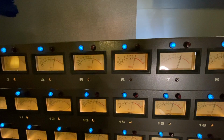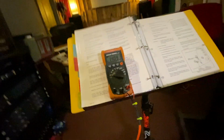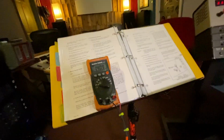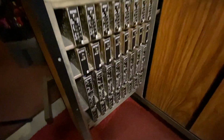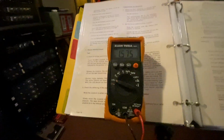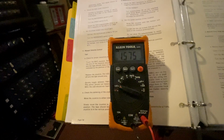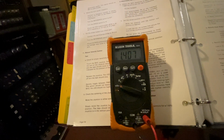Now I already did channels 1 through 7. I'm just going to show you 8. And there's channel 8, and we see it's down, right? So 1.4, we're high. So what I'm going to do is I'm going to come over here to channel 8, go to the in-cal. Now, if you look at the multimeter, I am going to adjust this to where I get 1.23 volts. So I'm going to lower it down.